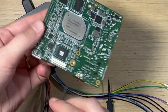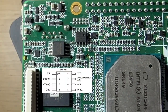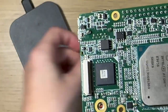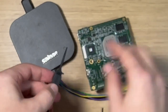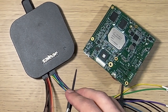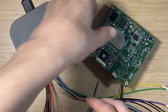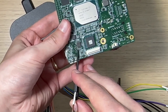If you remember your data sheets, you need to first figure out which thing is pin one. Let's zoom in here — we can see the dot there that indicates that pin one is going to be the one furthest to this side. These particular probes have a little grabber on them, so you press down and then you can grab. You're going to press down and connect it to pin one.